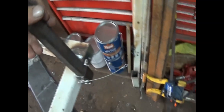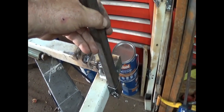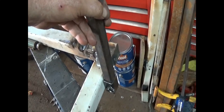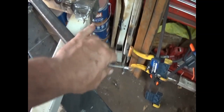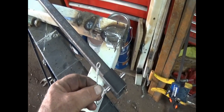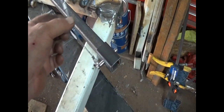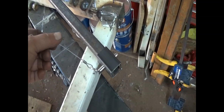Cutting it all. This is what I'm making. There's all the ones I just finished cutting — there's all the pieces I'm using, putting in the vise. These will get welded on here like that, and then the boards will get screwed to them. When you want to take the sides off, you just pull those pins. The handy thing about these pins is they've got this cable — you throw a screw through that, through the wood, pull the pin, pull your sides off. Pins are always with the sides, you never lose them. And by the way, these are scrap finds too — pretty much everything on this trailer is scrap find.